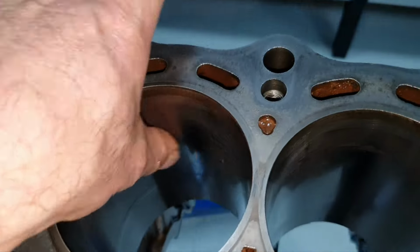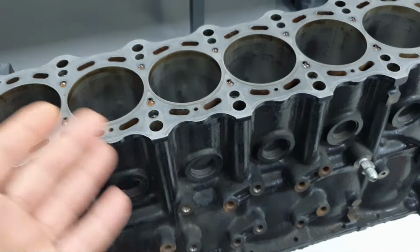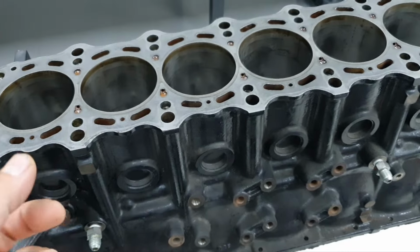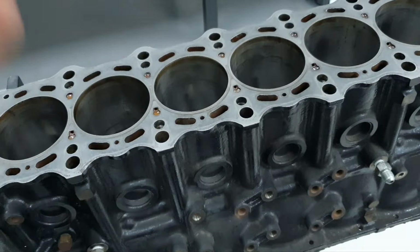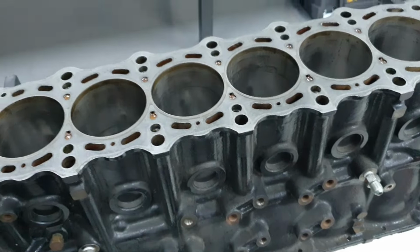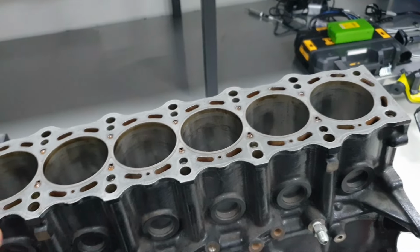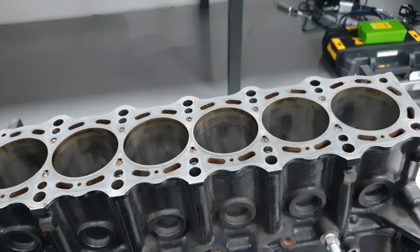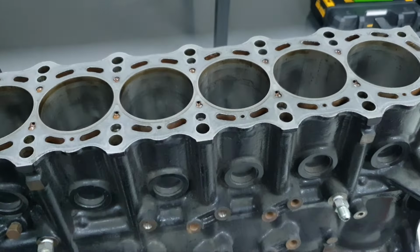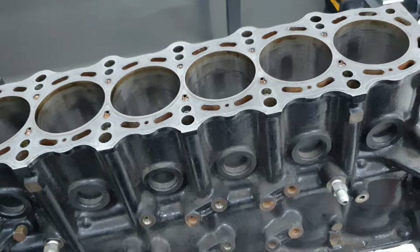All right, there, you are going to have some blow by with that. Some people are going to think, you know what, it's fine. It's fine if you run, let's say, 15 PSI of boost, or 30 PSI of boost, but think about running 60 PSI of boost, 4 bar of boost, and revving up to 9,000 RPM. You see what's the difference? It's like the people who burn the piston rings, they say, I'm driving the car normally and it's okay, but as soon as I'm pushing and it's building up boost, the car starts smoking. That's exactly why. So this is going to be acceptable if you were running 15 PSI of boost, you're not going to have any blow by. You're going to be fine because of the pressures and the temperatures inside the combustion chamber. But not for this application, that's my point, all right?